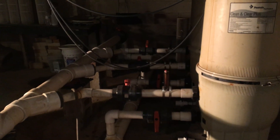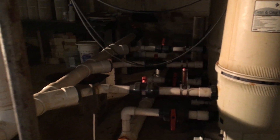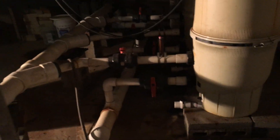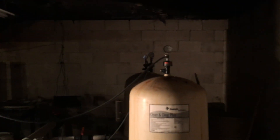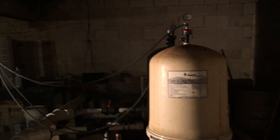These little hoses are bleeder lines — they bleed the air out and drain right back into the pit over there so you don't lose any water, because the pit runs back through. So: the big valve back there is on, the drain is open, water comes in, then we open the top valves, turn the valves on, go to the back, wait till the water comes out, close it, then move on to the next one.